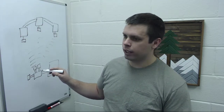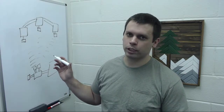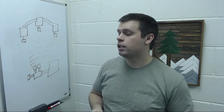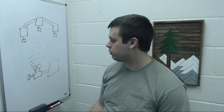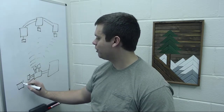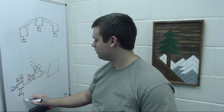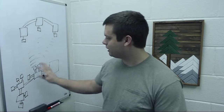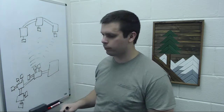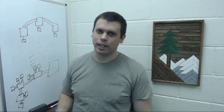actuator that we use. But there's 5 actuators in the arm. There's 2 actuators in the head. There would need to be a Bluetooth module in the gripper, so you can send and receive commands there. So what is that? It's 8 in total. And then the Arduino Mega only has 4 hardware serial ports. So you need to connect it up to another Mega over here, which also has these modules here. There's your 6, and then there's your 8. So then the wiring and the complexity of all the electronics in the base of the robot just was crazy. Like 3 Megas, 8 Bluetooth modules, just so we could communicate with the actuators on top.